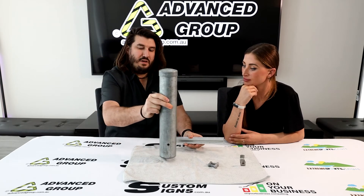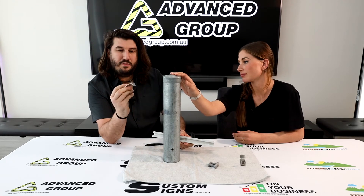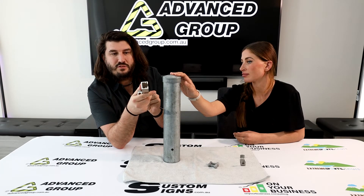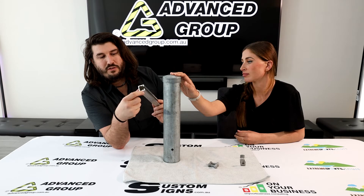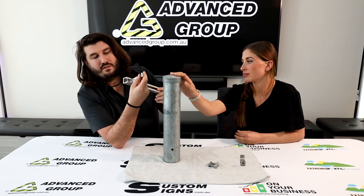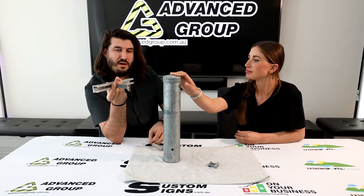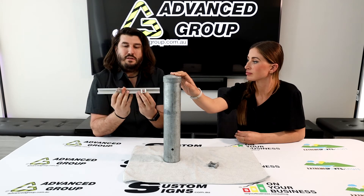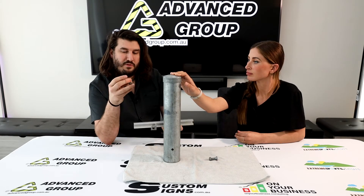Say for example if you have a larger diameter pole than a normal one — this is not perfect for these clips, but we can still demonstrate it. You'll see the profile of this strut channel: it has a couple of fins in the middle, so it's like a U-channel or C-channel with a couple of fins. This part of the clip can be slid into that part of the channel. If you have two of these in the channel, that gives you the ability to put in some special bolts and nuts.